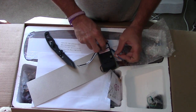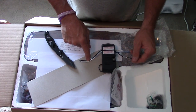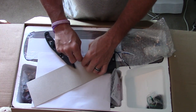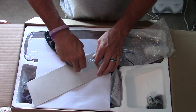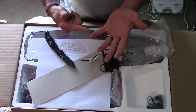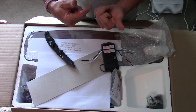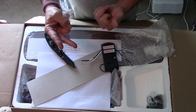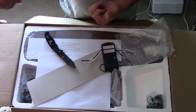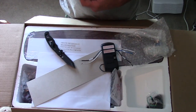On the fan side, this is for your neutral. The blue wire is for your light, the black wire is for your fan. Now if you live in a house where you've got a switch for your fan and one for your light, you have to decide which wire you want to put on here. When we used to wire houses we'd wire them with a piece of three-wire — that's a black, a red, a white, and a ground. If you've got two switches in that box, that's what it's for. Normally what I would do is use whatever wire controls the first switch, and then the other wire — be it the black or the red — you just put a wire nut on it and cap it off because it will no longer be used.